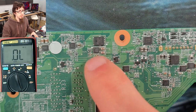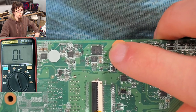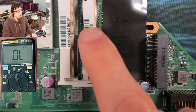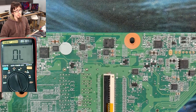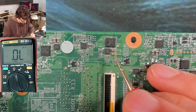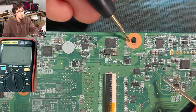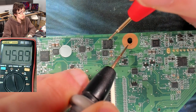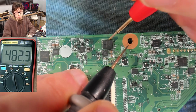Travelling up here, there's another big MOSFET stage. This is going from power to ground — there's a screw hole there. What's on the other side of the board? That comes up to there — this is going to be memory Vcore, because that inductor is going up into the memory channel. Let's check — ground to there. There's resistance. I think this might be a dual MOSFET package — checking that pin up there as well. There's resistance there; it's in the hundreds not thousands of ohms, but it's not our short circuit. That's the important thing.